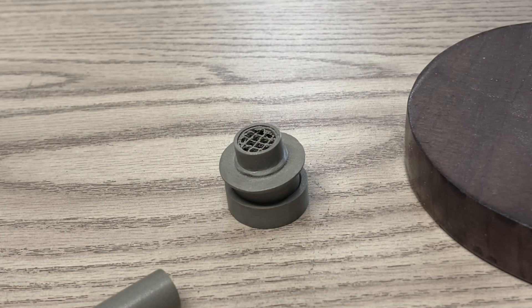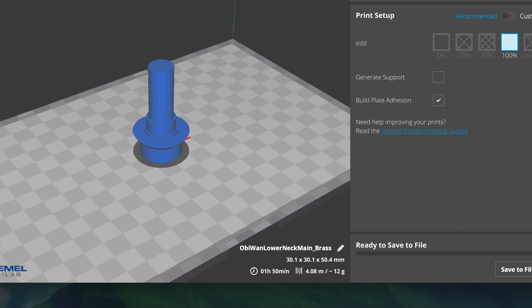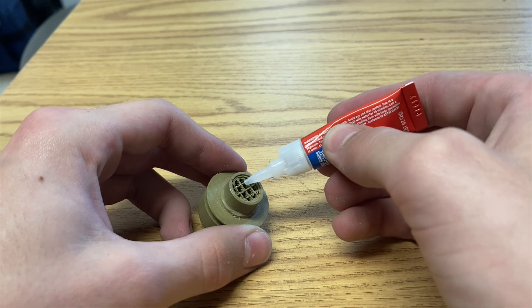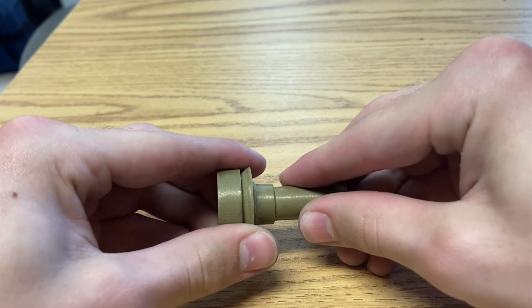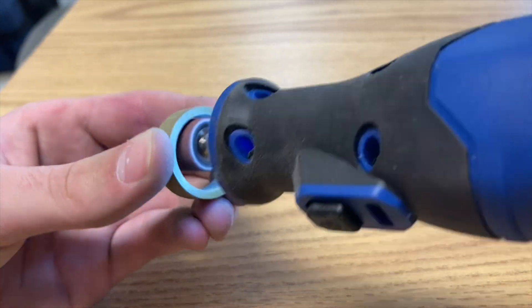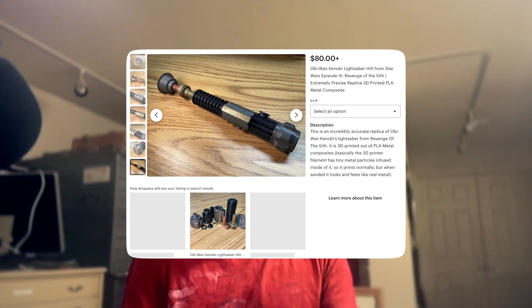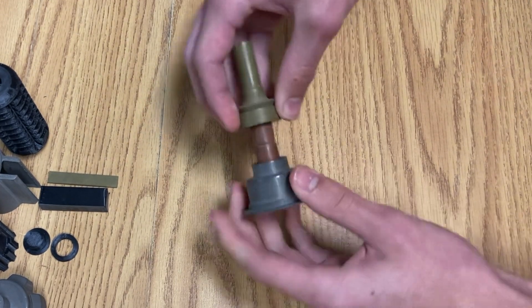The tolerance was way too tight on those pieces, so not only was filament wasted, but we'd have to reprint, which takes about two hours. Instead, I used super glue to glue the brass piece back together almost invisibly, sanded out the inside of the ring until it could actually fit, modified the 3D model for future builds — like the ones I'm selling on my Etsy store — and glued the brass piece onto the copper one.